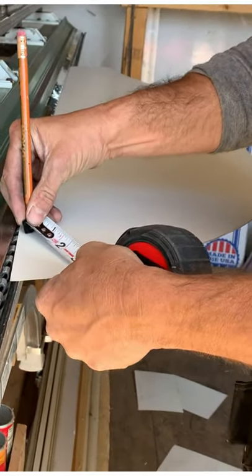But between the brick and the center, you just glob that caulk on. I'm going to dry fit this one again, mark my center, and cut it — that's where the keystone is going to hide. Since we trimmed the other piece, I'm going to need to trim a little bit off this one too. This one fitted a little bit better, so I don't have to trim as much — just need to trim off the top a little bit.